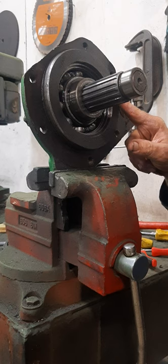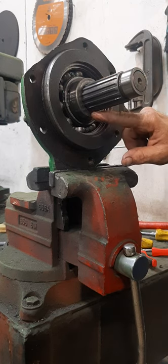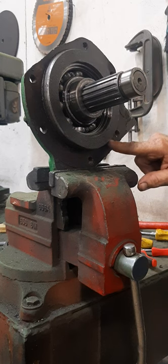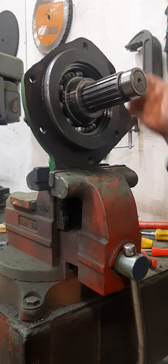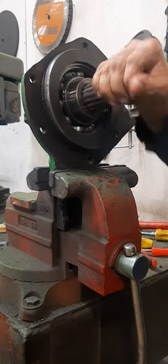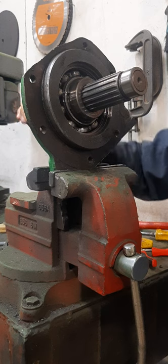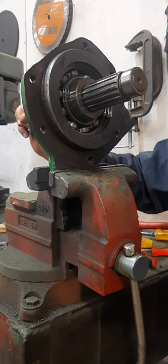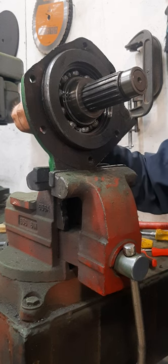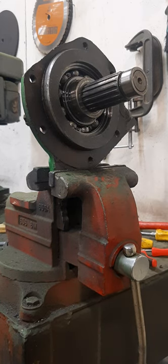Now this is ready for installation. Make sure this wave washer here is in good shape, put a new gasket on here, snug these six bolts up and tighten them good. That seal is brand new with fresh grease, ready to seal this 44-40 off again. Till next time boys and girls — I appreciate you; hit subscribe and like if you wish.